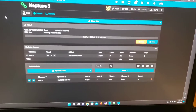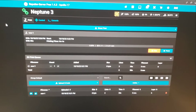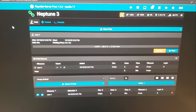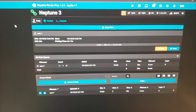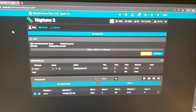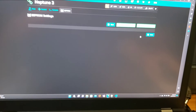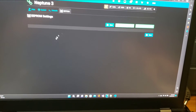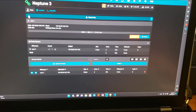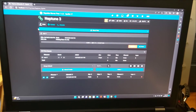Right now it just got done with the G34 and you can see right here it's already a four-minute cycle. So it's going to run through the auto bed level right now. The only thing you have to take into consideration is that it's not going to prompt you to set a Z offset — it's just going to go based on the Z offset you have set up in your firmware, under your EEPROM settings. When the machine is not in the middle of a cycle, you can actually see and manipulate the EEPROM settings in your software of choice.